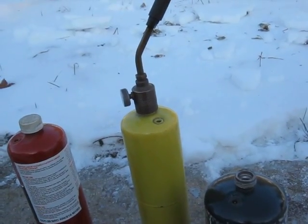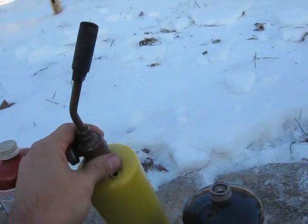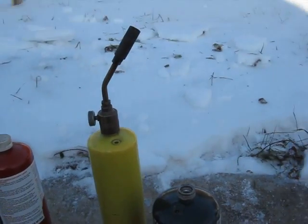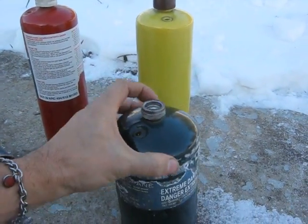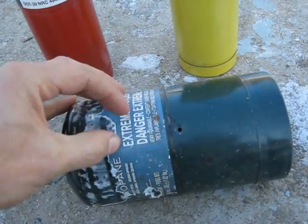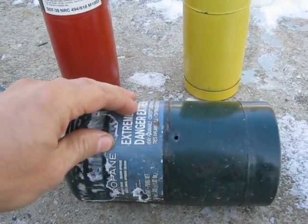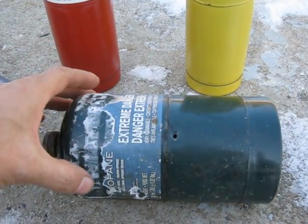You don't want anything in the tank — you want it completely empty. There should be no smell when you sniff the end of it, absolutely no smell. This one was left at least a couple weeks. I drilled a hole in the center very slowly to not generate heat, so that it guarantees that the tank is empty.